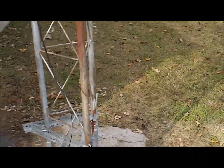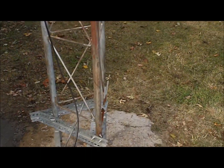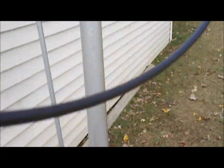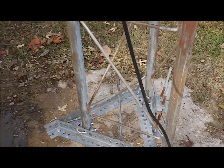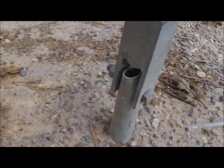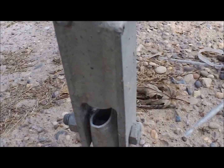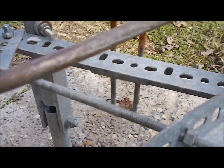We did run into a problem. I had too much of an angle out in the yard and we got that pulley block caught up in the leg of the tower. Roscoe and Jimbo were trying to control the pole out to the side, and I was watching them for speed cues. It suddenly got real slow — we had it pinched in there and I was pulling the whole tower down. I looked up and the tower looked worse than the Leaning Tower of Pisa. It really boogered the rear leg up where the bolt goes through — egged this hole over here.